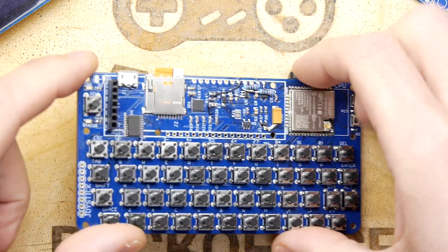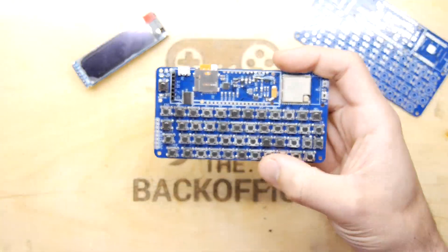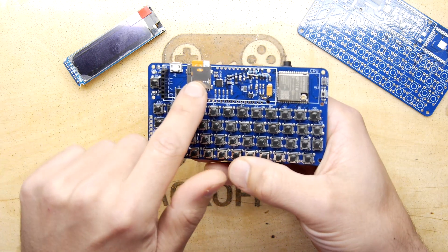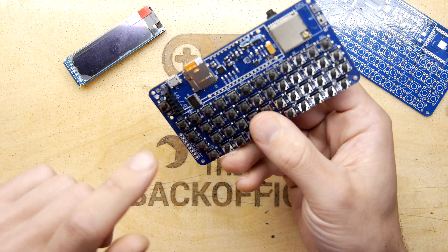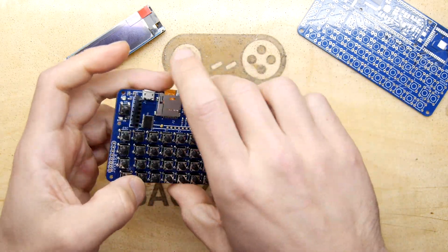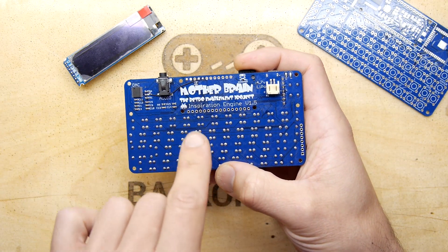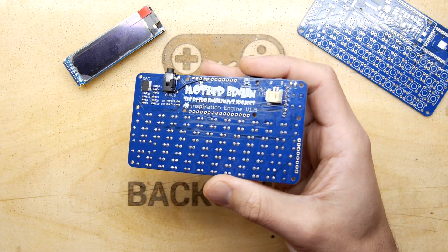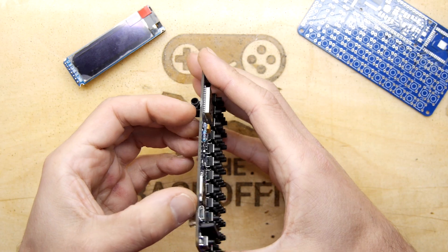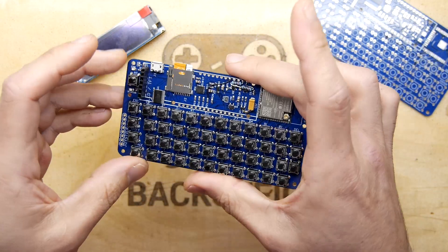There's a keyboard interface here running through an I2C port expander which also allows an Atari joystick-type interface, so you'll be able to run this with a standard joystick - though I haven't tested that part yet. This module is the wrong module - it has an external antenna, but I've footprinted it for the internal antenna. Wi-Fi is working great. I've been working with some chaps on Discord - Chrissy and Andrew Beer - and they've really helped getting everything working. The SD card, audio DAC, and keyboard are all working great. We have had to modify things slightly, so compatibility with Adafruit Feather may be limited - we might only be compatible with our own upgrades. There's already talk of making a VGA adapter card or composite card, so you could run it in a box, make a little computer, or even shove it into a ZX Spectrum that doesn't work anymore.